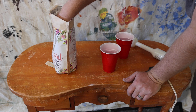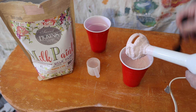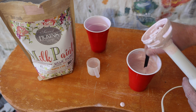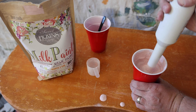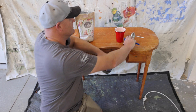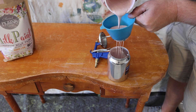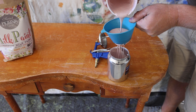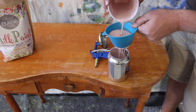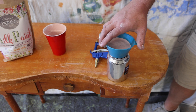This is 70 cc's. Now that I've got my scoops in I'm going to use this same thing to measure the water, then the immersion blender goes in. I like to take a plastic fork and make sure I'm scraping the bottom because there's a little gap between the bottom and the blades, and it might not get everything churned up. The milk paint with the immersion blender is going to be pretty smooth and creamy, but you don't want chunks blocking your siphon. Strain it first — I'll let that sit and drain.